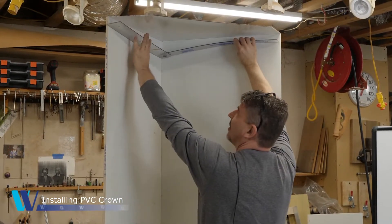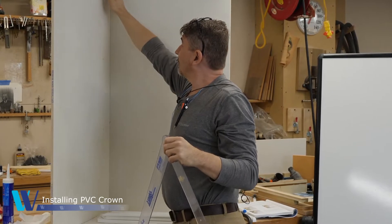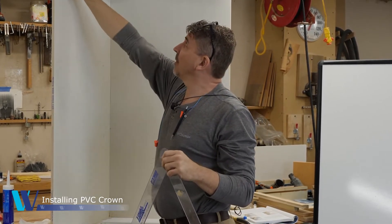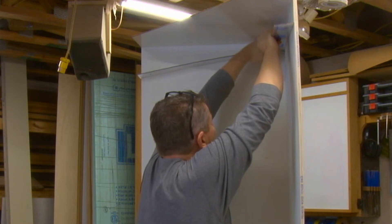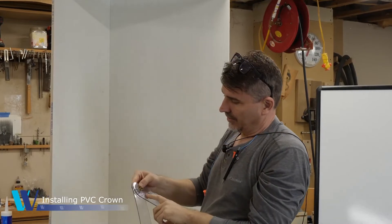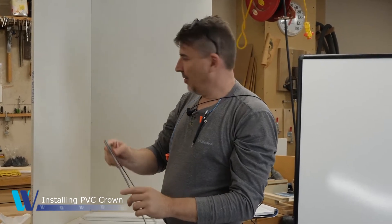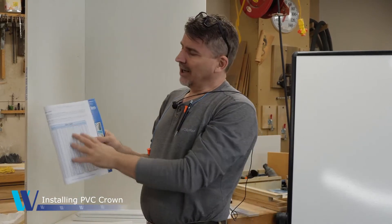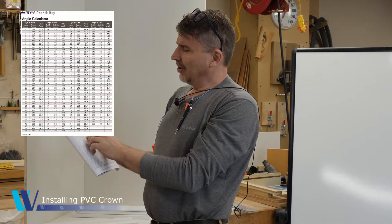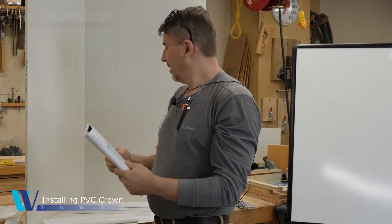You'd want to use it, and it's so wide because typically with sheet rock, it'll fill in and throw the angles off tremendously around the inside or outside corner. So you want to capture these outer points. We'll throw the device in, lock it down, and then come down and determine the angle. This is 90, which isn't typical, but if we get a 92 or 88-degree angle, this book — also available on our website — has a mitering chart that says if you have a 92-degree angle, you would set your chop saw at 44 degrees. It's listed in half-degree increments.